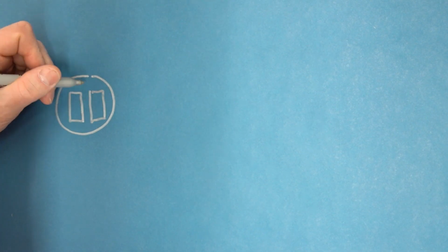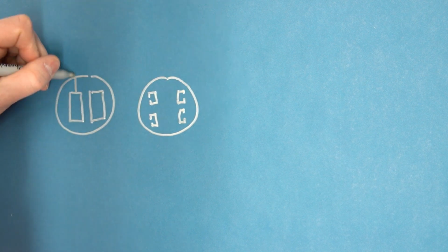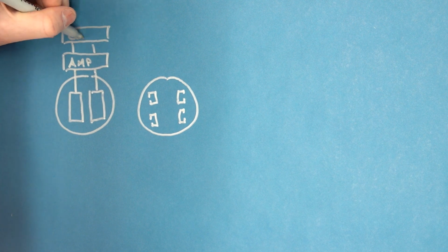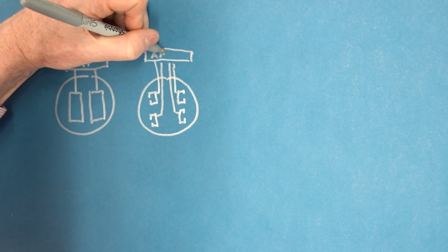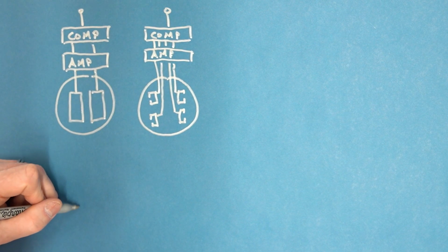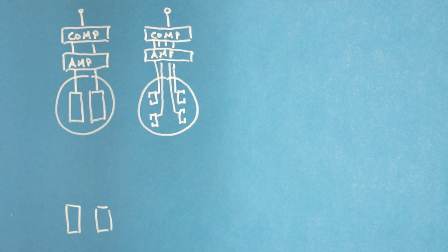Let's take a look. The PIR is a pyroelectric sensor with multiple sensing elements, usually either two or four, on its face, each with their own detecting areas. These are connected to an amplifier and a comparator. They're designed in a buck configuration, which cancels out sunlight, ambient temperature variations, and other atmospheric changes. And when the voltage from all sensors is the same, everything is Jake. However, when something warm passes in front of them, the voltage changes in one, then the other, indicating motion.